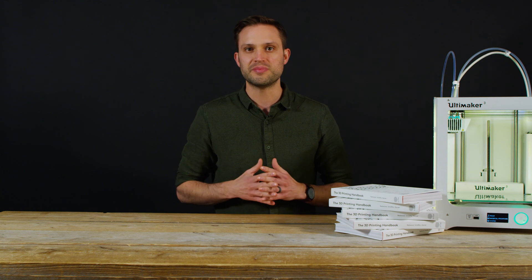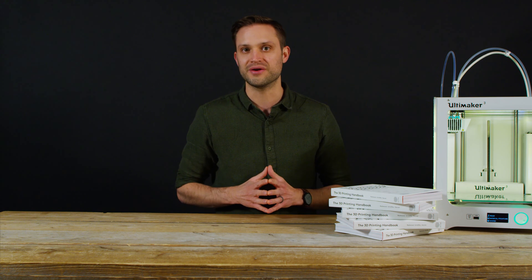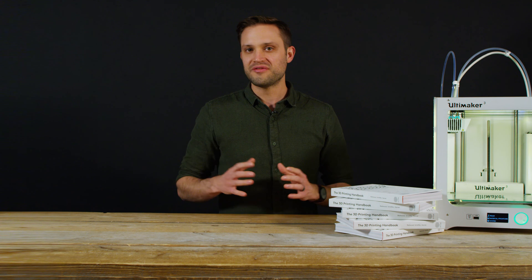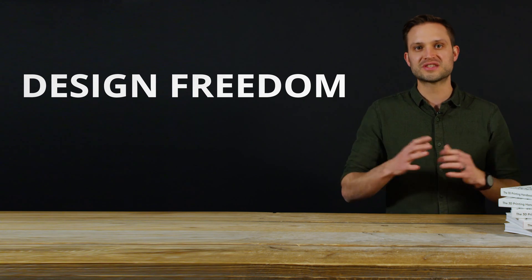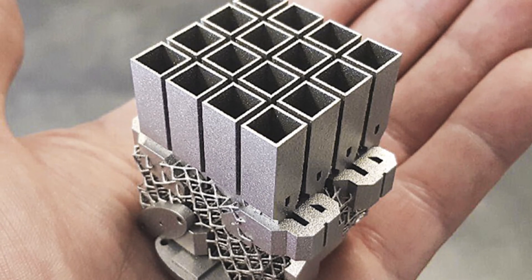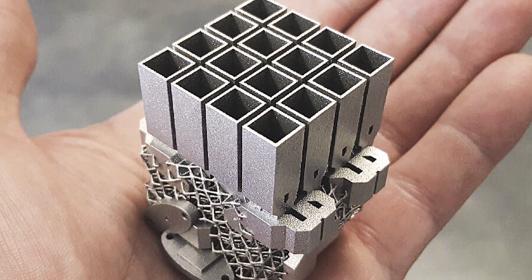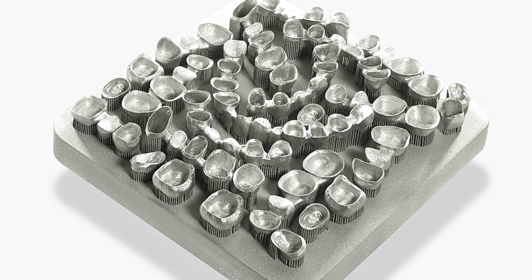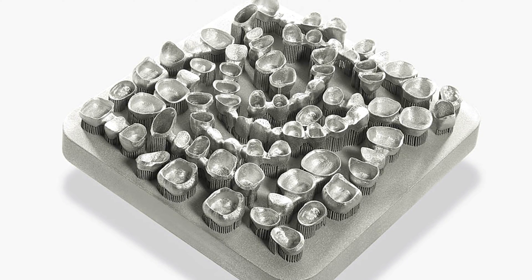But there's one key difference: metal 3D printing always requires support structures, something SLS doesn't need — and we're going to talk about why later on. One of the biggest strengths of metal 3D printing is design freedom. You can now print parts that were previously impossible to produce using traditional manufacturing techniques. Two particular areas where metal 3D printing is having a large impact are part consolidation — taking 100 parts and metal printing them to be just a single piece — and the production of parts with integrated lattice or porous structures, particularly useful in the medical industry or where strength to weight ratio is very important.